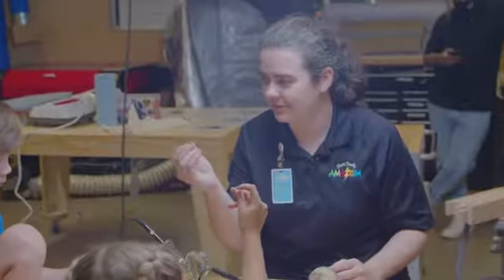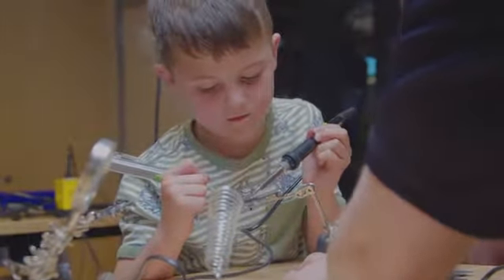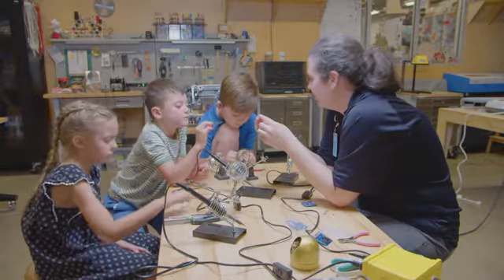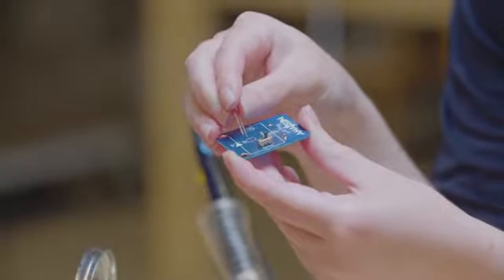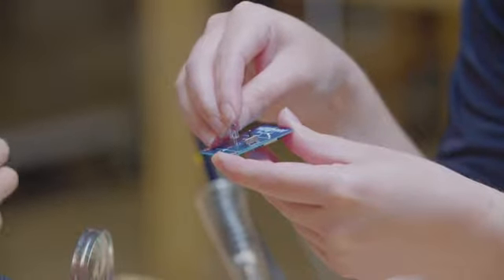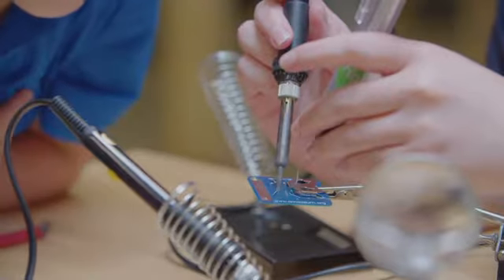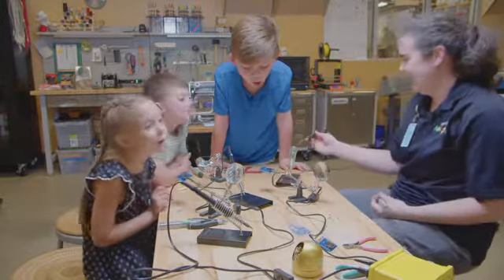Who's ready for round two? We're continuing clockwise and we're looking at our LED. We have one that has more of a positive charge and that's going to be the longer one. And then on our little chart, the one with the line towards the end is going to be more of our negative side. So we want the longer one to go in right there — the left hole. We're going to bend our prongs a little bit so that they stay there while we're soldering. So we're going to do our little heat first, and then we're going to dab it — dab our solder.